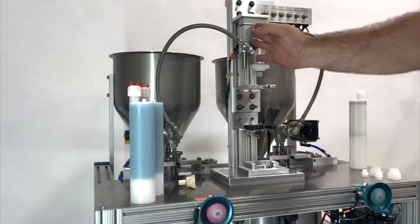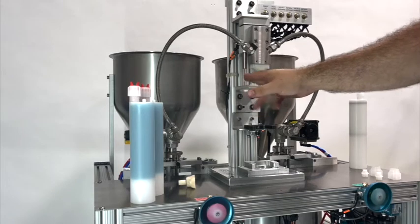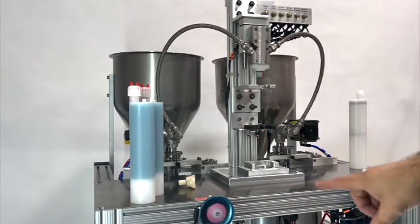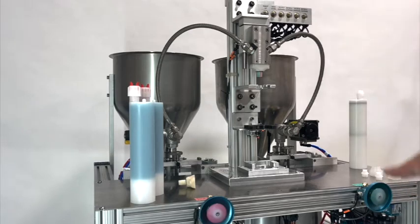We've gone through the process of moving the dispense head over to the right, moving the upper cartridge support bracket over to the right, installing the TA cartridge nozzle and getting all of that aligned properly. We moved our inserter limit switch down to the top mark, opened the inserter down speed control all the way counterclockwise, and adjusted our A dispense delay to the letter E in the downward position, as well as made our volume adjustments for the proper fill level on our top cartridge.